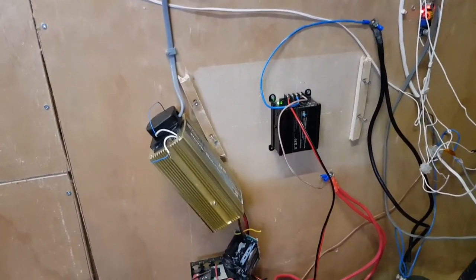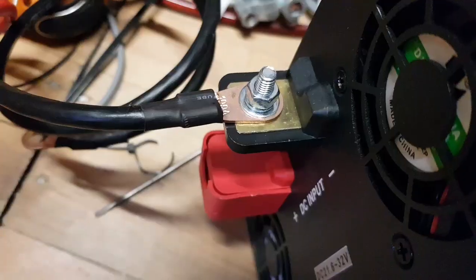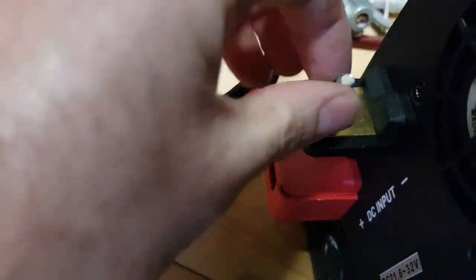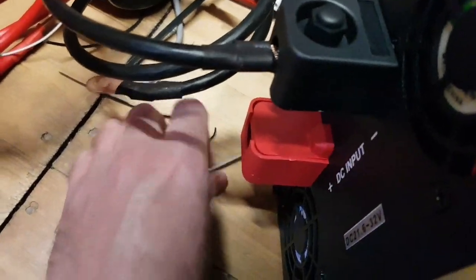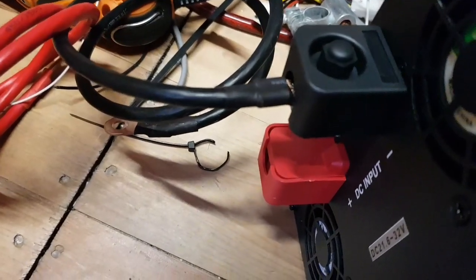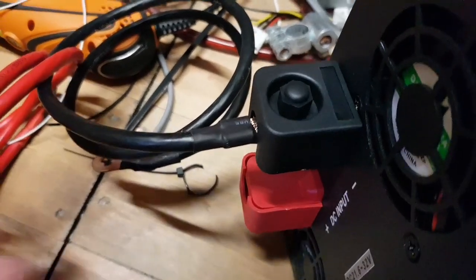That's all we need really. The wire termination terminals are quite nice and sturdy — you've got a nice copper slug there, you bolt your cable to it, and then you've got a nice little black cover or red cover for the positive that goes on there with a little nut, keeps all the connections hidden and safe. I like that, because what you could have had is a piece of metal come along, touch there, and you would have a big explosion on your hands.